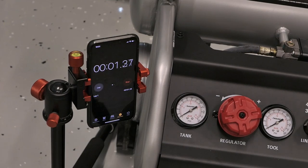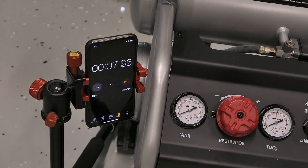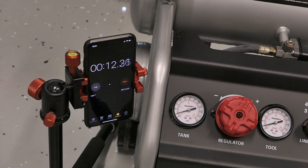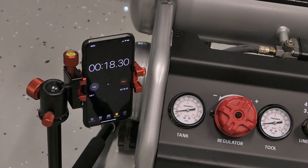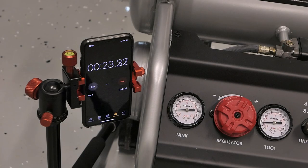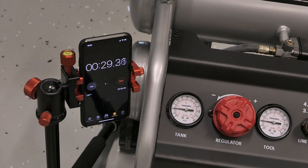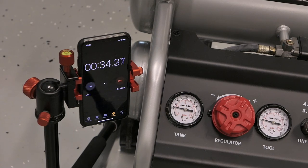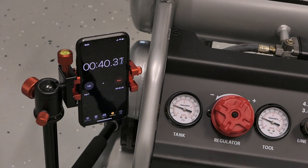But before getting going, let's take a moment to see what our charge time looks like. And while we're doing that, let's consider how much air we're compressing. Because this unit charges to 175 PSI, its smallish capacity of only 4.5 gallons punches above its weight class. Using Boyle's law, we find this unit holds 53 gallons of atmospheric pressure air. By comparison, my 6-gallon Porter Cable rated for just 150 PSI holds 61. So despite having 25% less storage capacity by volume, the Husky only holds 14% less air.